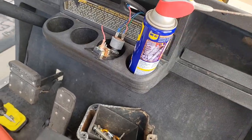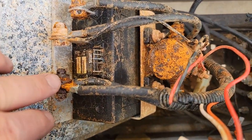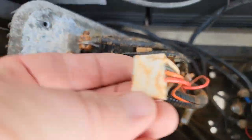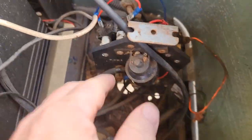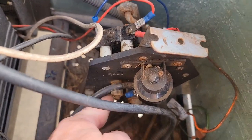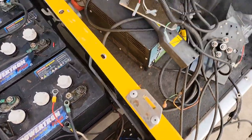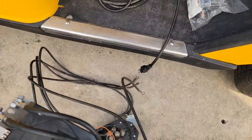The solenoid is just in really bad shape, and these wires here are in really bad shape too. Even a little connector that was plugged on the pins looks terrible. This is your forward and reverse selector — I ohmed everything out and it seems to be working, but with the contacts in such bad shape, I just don't trust it. So yesterday I got really lucky and scored a whole assembly.